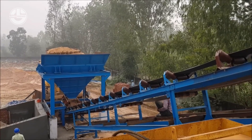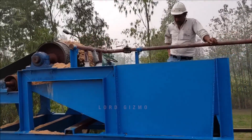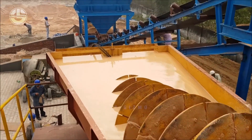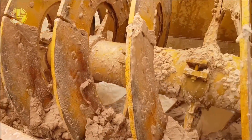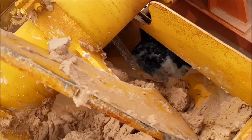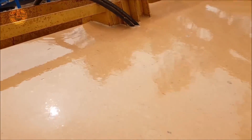The process does not just stop there. As you can see, there is still a lot of water and some impurities left even after the initial washing. So the sand will go through another round of washing. This is to ensure that only sand and no other debris is mixed in, but this time the sand will be exposed to water after it has been through a screw classifier. Most facilities do this to remove all the debris, clay, and organic matter. If they are using heavily contaminated sand, it is necessary to wash it twice to remove all the unwanted debris completely. They might also do this to reach the desired purity level.